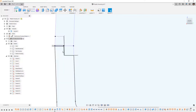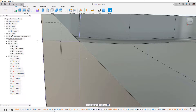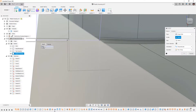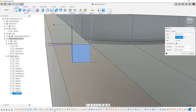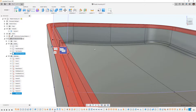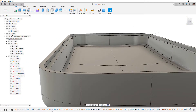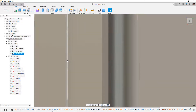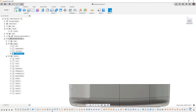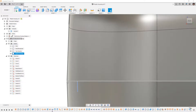I'll finish the sketch and focus on the bottom housing first, since all of that material gets cut away. I'll bring back the bottom housing and turn off the section analysis. Under Create I'll select Sweep and choose our profiles — holding down left mouse button to select all three regions that are going to get cut away. For the path I'll select the entire outside edge, letting it go all the way around, and click OK. The preview showed a small sliver but once done there's no extra geometry. Viewed from the top we can see the inside walls with two degrees of draft. From the outside, a small amount of material was removed. Bringing back the top housing, you can see there's a small gap — that will be part of our reveal.